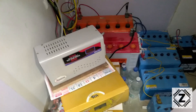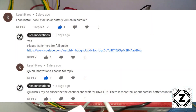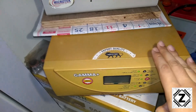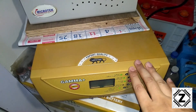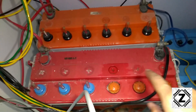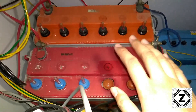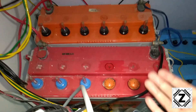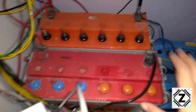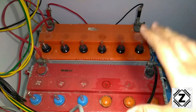Welcome to Zen Innovations. Today we're going to talk about parallel batteries, because a lot of you are interested in connecting parallel batteries for your solar inverters. I have my UTL Gamma Plus installed here — it has a 40 amp MPPT-based charge controller. We cannot give 40 amperes to just one battery, because a 150Ah battery should be charged at 10% of its capacity, which is 15 amperes. If you want to use 30-40 amperes from your solar inverter, you need to put batteries in parallel.